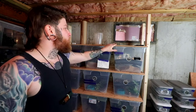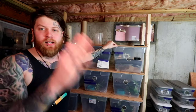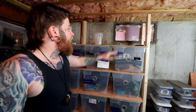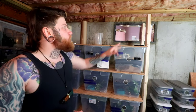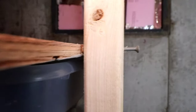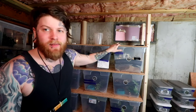My recommendation is to get the boards about four and a half feet. The only issue is you'll need to buy more sheets since it won't be a clean even cut from a four by eight. However, it's going to make your life so much easier. You can technically do the four-foot boards, but lining them up with the stakes and posts will be very difficult. Do yourself a favor — add an extra half inch to each board and you'll save yourself a lot of time and hassle.